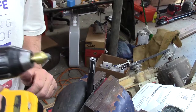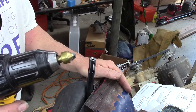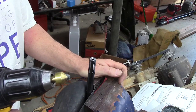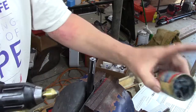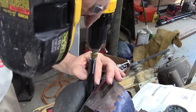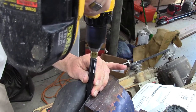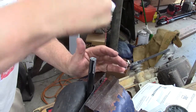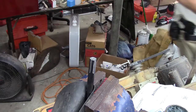and make sure I'm really happy and done. And I'm going to use this tool that one can turn on the lathe, or hold a piece of stock against a grindstone, or use a brass slotted head screw. That works fine. That's been done forever. Anyway, I'm using the fine side of a valve lapping compound. So I do just a very small circular motion, and make sure it's done really good. Get a little piece of paper towel.